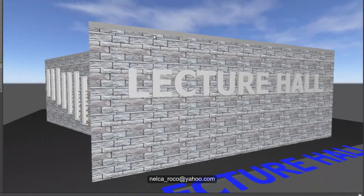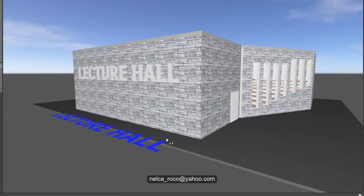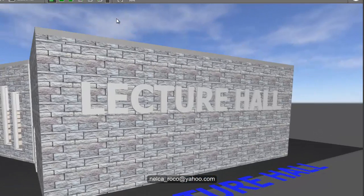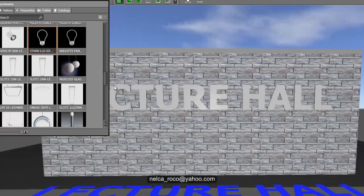So there are two ways to light it. Either you want to light it using LED from the back, or of course the common style of wall washing. I mean highlighting a wall, which is wall washing. But our lecture right now is to do a lighted signage. So we'll go now and select our LED and see how it looks when we put our LED strips at the back. Okay, I will select now the LED strip that we will be using for this lighted signage.